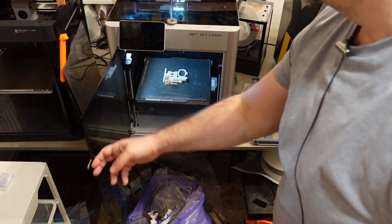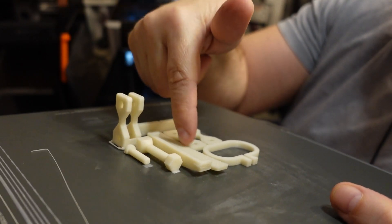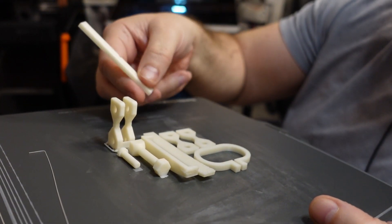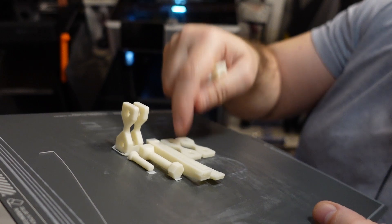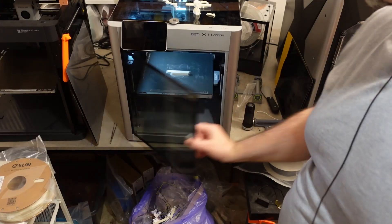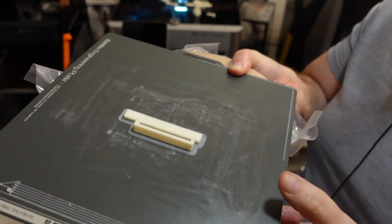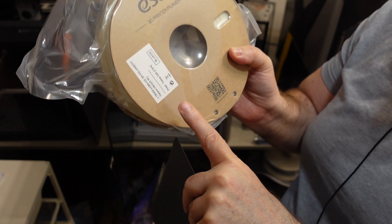Let's see the first attempt. Two objects have to be reprinted: the temperature test object — the most important for this material — and the bending test object. Others are perfectly straight. The adhesion is acceptable, but I definitely have to slow it down. This time I added a brim and reduced the flow rate to 8 cubic millimeters per second without changing the print temperature. It finished correctly. Not the easiest material for printing, but now I'm moving to the glass fiber version, which is probably much easier and can be done at higher speeds.